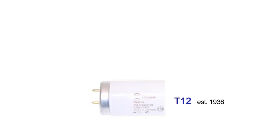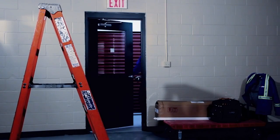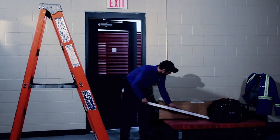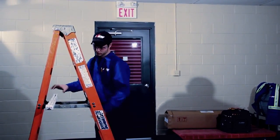You're going to see three technologies today. We're replacing T12 and T8 product, which have been around for decades, and we're replacing it with T5 — the most efficient linear fluorescence on the market. Our main purpose in this presentation is to show you how much this self-ballasted solution speeds up the switch from T12 and T8 to T5 fluorescent lighting at your facility.